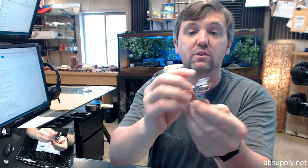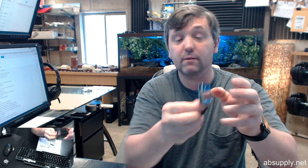Well, how far is it inset? That's really going to be the ultimate question. That is the limiting factor, the fact that they're inset. So when you get the point of it being opened, you've got 90, and then by the time, assuming that the glass is flush with the exterior face, because it's inset, yeah, you're probably going to be about 140 degree. Forgive me, I momentarily forgot these were inset hinges.